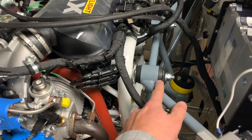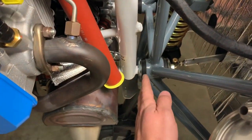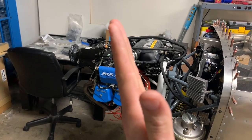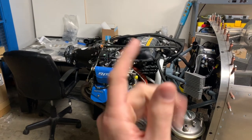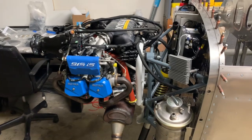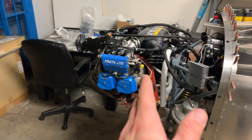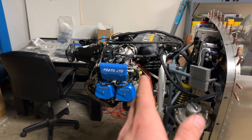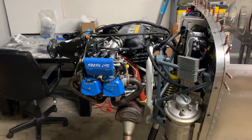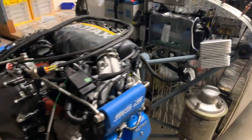Basically, on the top the harder rubber is on the back, and on the bottom the harder one is in the front, because the engine at rest is creating a rotational moment — it's going to pull harder there and push harder there. I thought that was a pretty interesting part of the process because even at the engine's greatest stress point, probably on takeoff or climb out, that's still the configuration. But that's what it says in the manual, so I trust it's accurate.